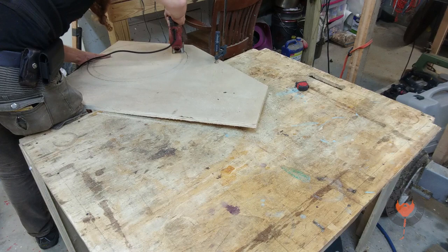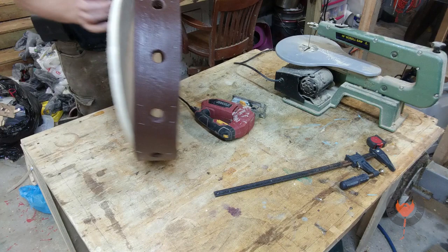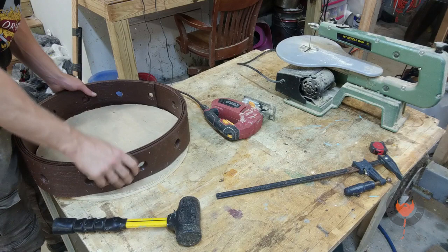It's just some weird witchcraft thing I don't want to talk about. This is a tabletop scroll saw. On a handheld scroll saw, the blade will flex in or out and you won't get a straight 90-degree cut. That's where the tabletop scroll saw really shines — it gives you a nice clean 90-degree cut.